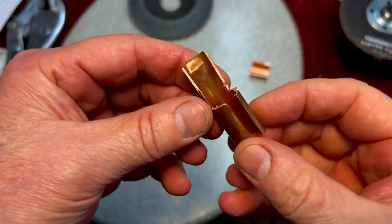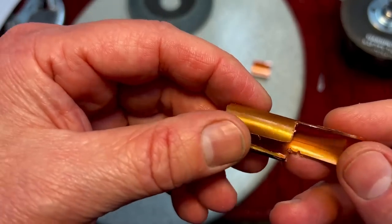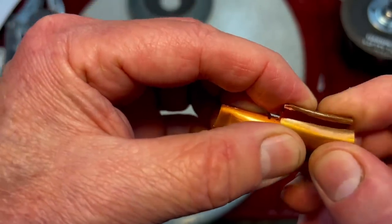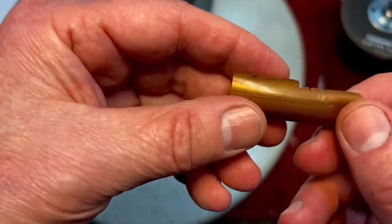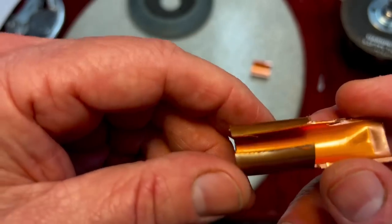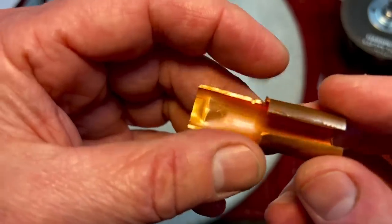You see what we did here — we just cut that out of the tube. Now here's what you have to remember: any kind of shaping or banging you're going to do from here on, you're going to have to anneal this. Annealing means making the metal into its softest state. What happens is anytime any metal is worked — and this was worked when it was drawn through the dies to make a tube — it became hard and brittle. So if you were to try and start bending this back and forth, it would break or split. We anneal it by heating it up with a torch until it becomes red hot, and then you can either dip it in water or let it cool naturally. You can only do that with copper and silver — with steel, you have to let it cool extremely slowly. We're going to heat this up now, get it into its softer state.